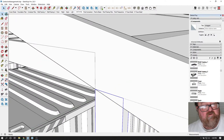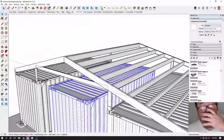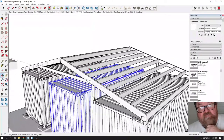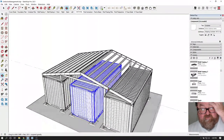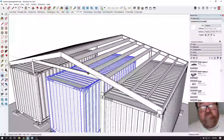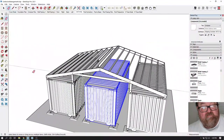So over your garage door, or over a window, or any kind of opening that's going to have brick above it, you would see a steel lintel, which is an L shape. And depending on the span and the amount of brick above, it would be engineered for that load. Get rid of my guidelines. I'm going to fix that.